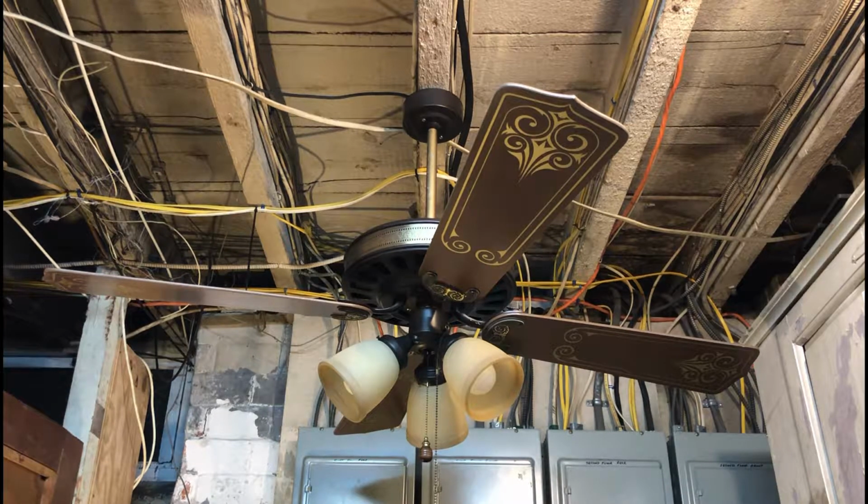The way the fan was wired, apparently it was jury-rigged to work solely off of a wall control. Whoever put the fan up tinkered with it on the inside, sort of like a Newton Veranda Deluxe, except they took the black feed wire and spliced it with the red wire, which is the highest speed for this fan, and just capped all other wires off. And apparently it was also run so that the wires for the light kit were also spliced into the black feed for the fan itself, even though this fan has a separate wire for a light. I'm not sure why it was wired like that, but it was weird. But anyways, I was able to fix all that and take care of it.